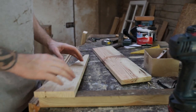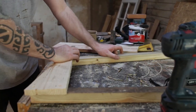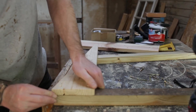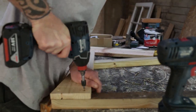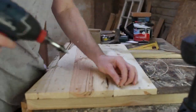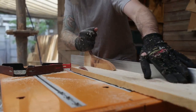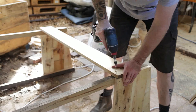So now I'm going to fix the sides. I'm going to have to pre-drill into this — it's a very dense wood, so I'm not just going to throw screws straight in because it will be problematic. So there we go, line it up. So these are the sides now. Now what I'm going to do is get the lengths for the front and back. I've finished the planing and put the screw holes in, so we're going to do that.